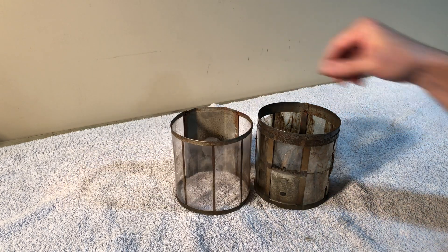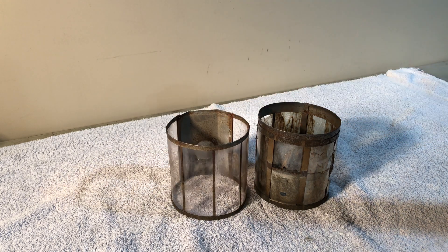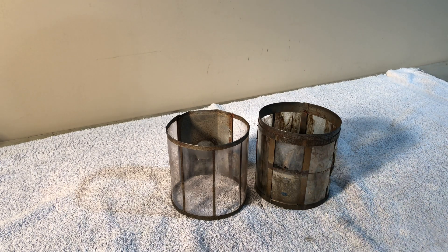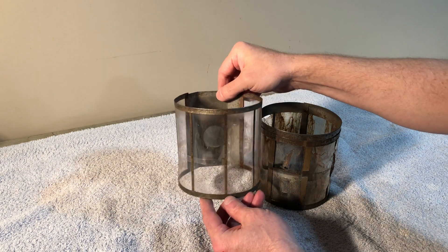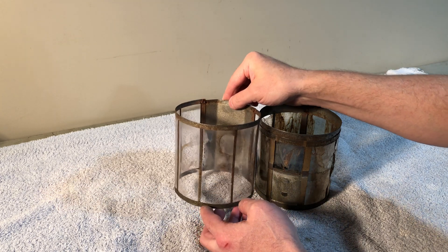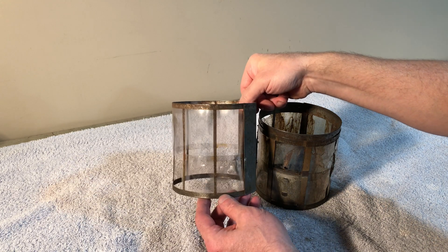This globe was equally rusty, but I put it last night in my usual mixture of citric acid. This is what I use — citric acid powder. I buy it at a beer and winemaking store, though you can also buy it online or in the canning supply section at Walmart or a grocery store. I put in approximately a teaspoon per liter of water and left it in for about an hour, maybe an hour and a half. The citric acid, when in contact with steel, will turn a slight yellowy-green color — it looks a little like urine, actually — but it doesn't get dark, and it cleaned the mica.